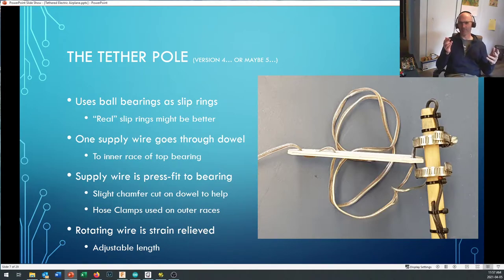The key behind this project is the tether pole. Without a simple and easy-to-manufacture tether pole, doing this project with students would not be practical. This is about the simplest and most durable design we've come up with — a straight derivation three or four links down from where we started at BCIT. These two wires come straight to our power supply — they run off about 20 feet of cable — and the power supply is designed to give high voltage at fairly low current so we don't get a lot of resistance in these wires.